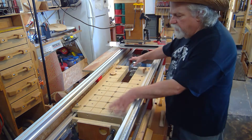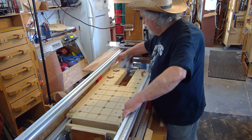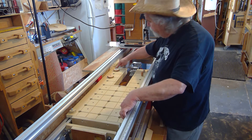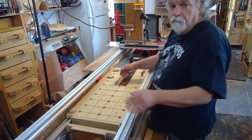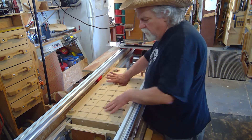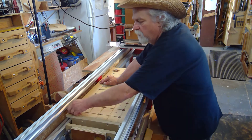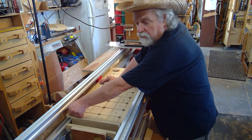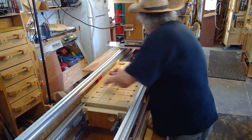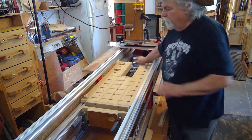In order to put it in, I put a dowel here and here on opposite corners — three-eighths dowel, same as my track dimension. When I drop it in on them, that gives me pretty much perfect alignment every time, instantly. So I know I'm square. I drop it in on the other two corners, push it up to one rail to make sure I'm parallel, and then just snug this down. Doesn't take a whole lot, and now this is held in place.